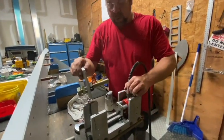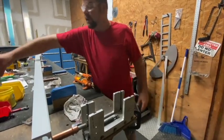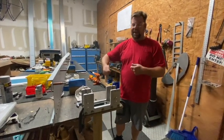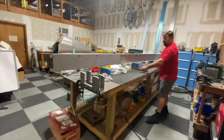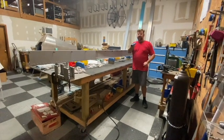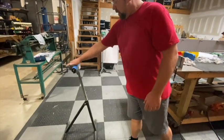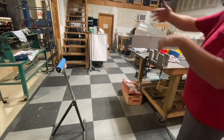Anytime you're going to put the spar in, I always take the rear component out and set it on my bench or on the ground so it's all out of the way — it just slides out and you can set the spar in without beating it up. We prime and prep everything really nicely here; the rivets are all perfectly set and beautiful. The worst thing is to bang these things around while you're just trying to maneuver the spar in. The setup here uses our big table and a piece of inch-and-a-half tube that's taped up and just rolls back and forth on the table. We have the roller here, and as the spar transitions, we have one of these cheap Harbor Freight roller stands adjusted a little bit low so the spar just goes out, leans down, and keeps going.